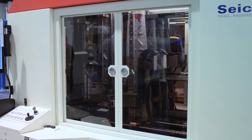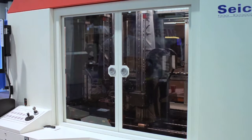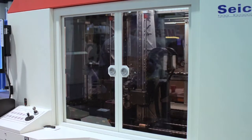Yes, this system is also unique in that we have up to 16 flying probe resources in this machine. We have our 8 electrical probes, 4 on each side, but we also have power probes on each side. We also have the cameras on each side. We also have the capability with laser scanning to actually measure the planarity of boards in the system, 1 on each side, and even stamping. Customers would like to have their boards stamped with either a pass or a fail. We can do that as well. And what's unique on this machine today also is we have LED sensors mounted in this machine, so it can also test LEDs. So you add all that up, we have over 16 resources that fly over the board.